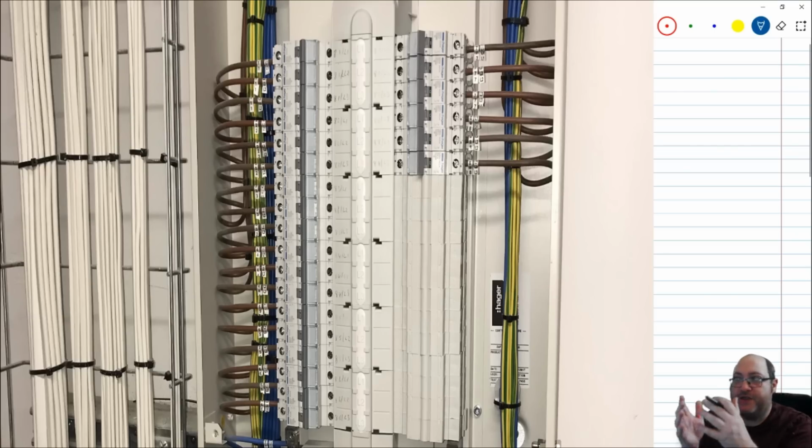So when you do these consumer units and you think about tying them up, for the cable management side of it, if you want to tie them up to work with them, you tie them up out the way to then connect them, as long as you then remove the ties and space them a bit in the space remaining to allow them to cool down and to run under temperature effectively, then that's fine. Tie them up for a management perspective and then cut them off. But don't leave them tied up. If you are leaving them tied up, you've got to make sure that the designer has accommodated that back at the cable calculations section.